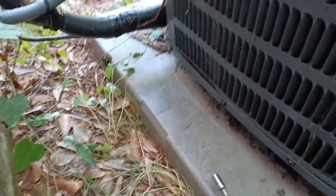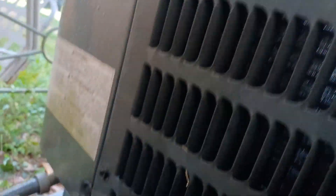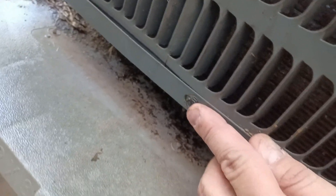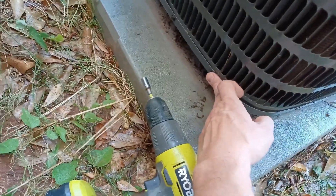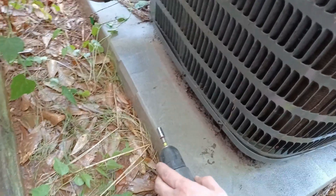Let me show you these screws — you're going to have to put them in. They're all over the place around the bottom, some on the end right there around the edge. What I would do is just put those in but don't fasten them all the way down at first. You see this is flimsy and it allows you to adjust where you need the screw. I've been struggling with it a little bit getting it back in because it's so flimsy — it's real light sheet metal and there are a bunch of holes for the screws. Just put them in a little bit to make it secure so you have room to adjust it.